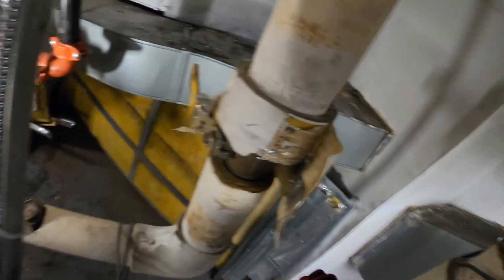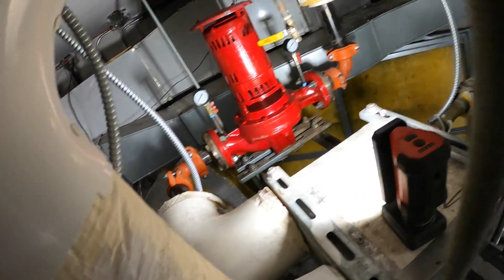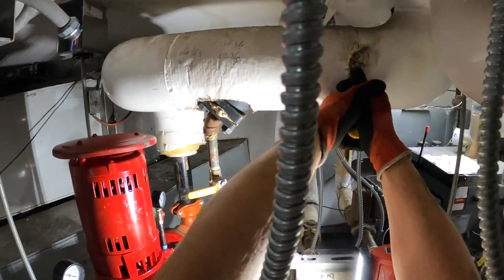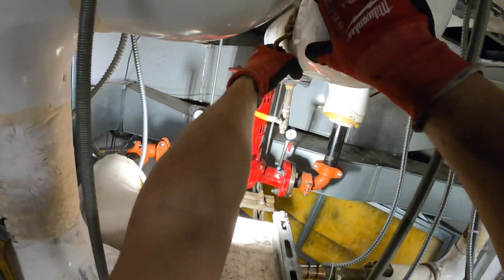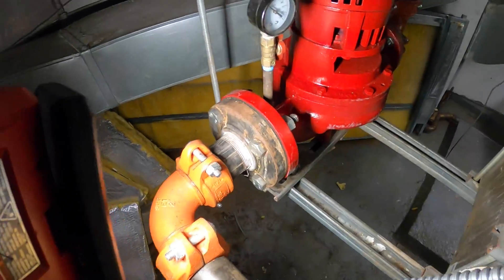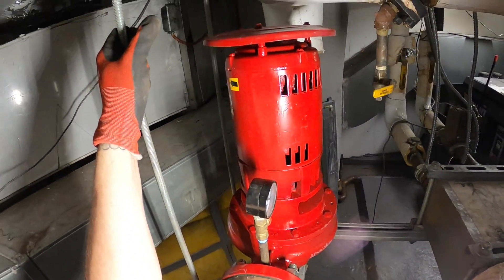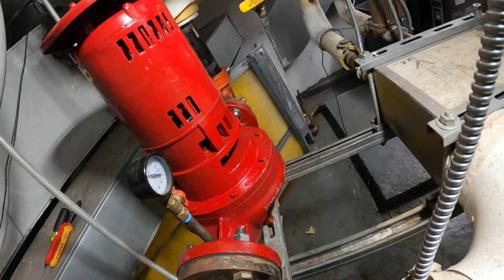Let's open up the water loop. This is just circulating through here — really these two. There's water on the line, I heard it fill up. Water lines are open. Everything's looking good so far — let's keep an eye on this. From here we're going to have to wire it. This is 208 volts, three phase. These wires are a bit short. We've got no leaks here — that's a beautiful thing.